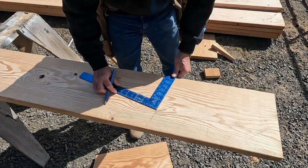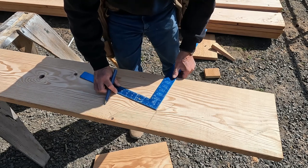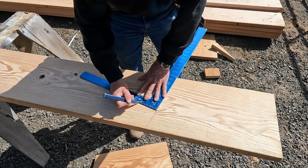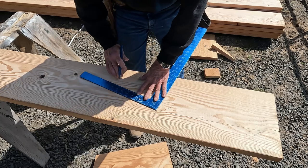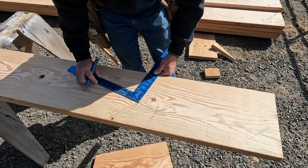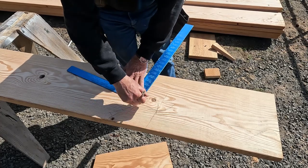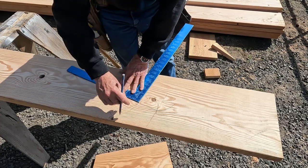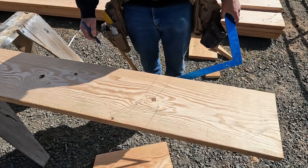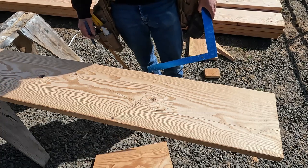I ran that a little longer so I could 90 off of it. A 90 off of 3/12 is a 12-3. My beam is three and nine-sixteenths, so I go to that measurement and then 90 off of that mark. That's my cut — it goes up and over the beam right there. That's basically how you do it, and I'll show you how to make the plumb cut up at the top as well.